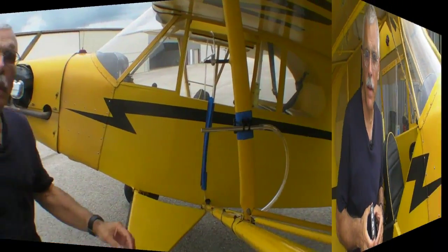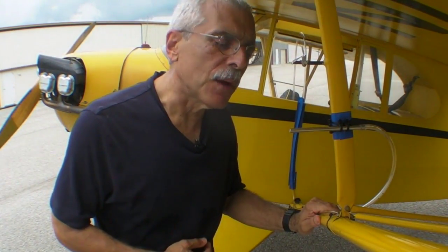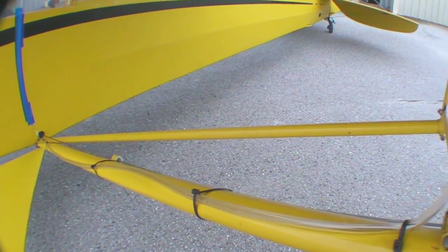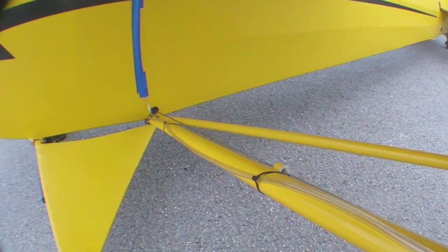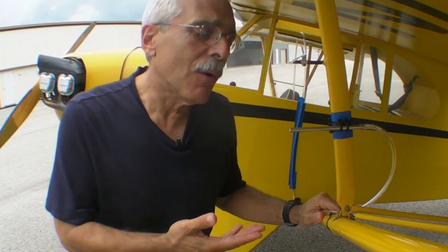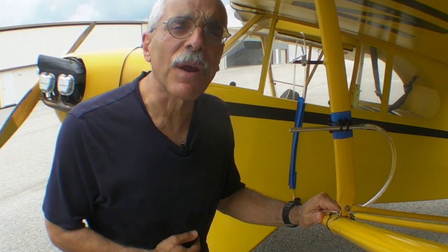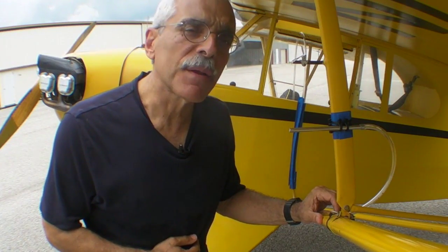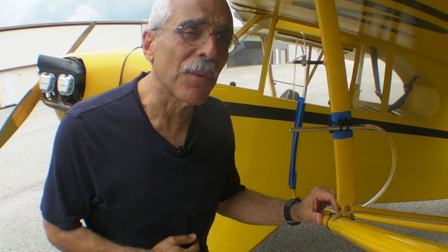You should check with your shop or the local FSDO to see if they have any heartburn with that. Now here in the Cub, I was just going to tee into the existing pitot system, but then I got a better idea — I installed my own temporary pitot tube. After all, what is a pitot tube but just a simple little pipe and some hose. So I ran my tubing down the length of the strut into the cockpit through the sliding window. Obviously this isn't corrected for position errors, but we're not dealing with the Boeing 787 here. On the other hand, the Cub doesn't catch fire every other week either.